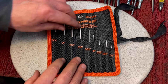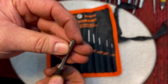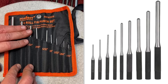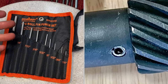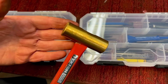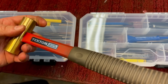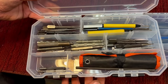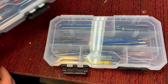We're not going to go into these today, but I want to show you how they work one day — these are roll pin punches. If you ever see a ball on the tip of a punch and wonder what it's for, that's for roll pins — those steel split pins. It's for taking them out without mushrooming them. These come in really handy and are important to have, even if it's once in a blue moon. We put all these punches in these two cases. It's always good to have a dedicated punch hammer — brass, one pound. Tecton made a really nice one; they were inexpensive on Amazon. Keep the containers not too deep so you can see what you need from the top.